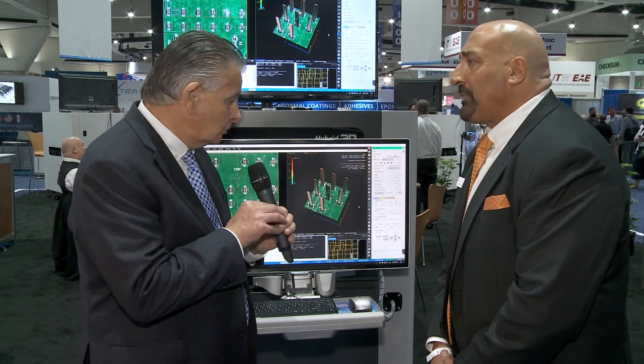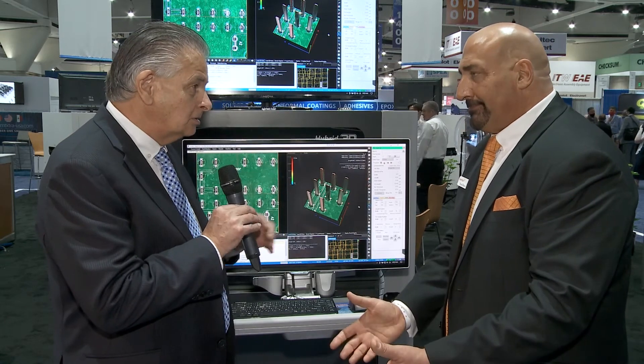So that does cost a little bit of time. If everything is within a certain range, we could use what's called an enhanced speed mode — it won't be as perfectly focused, but for applications where we have almost a sweet spot between the pins, we can keep it at one stage and inspect the board much more quickly. Many automotive customers are talking about accuracy, so sacrificing some speed doesn't really matter at all. You'd rather have the accuracy — you're talking about vehicles, you don't want any escapes. If you have escapes, people can die. So accuracy is what they'll wait for.